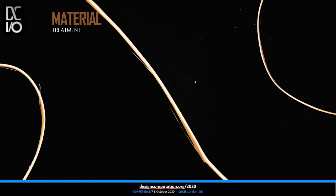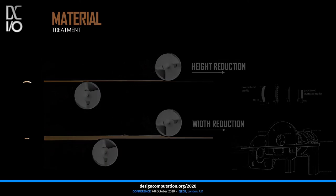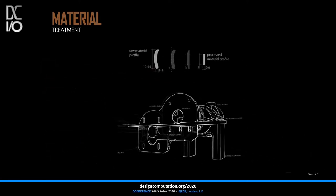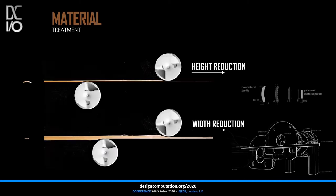As this raw material is not perfect, it has to be processed to make it a workable replacement. On the top left you can see the willow profiles before and after treatment with specially designed trimming tools and planers. With milling bits, the top and bottom part of the twigs get cut to remove the surface curvature. The second step cuts down the sides of the twigs to get a constant filament string profile. The most material-efficient width and height for a constant profile turned out to be 3x0.6mm.